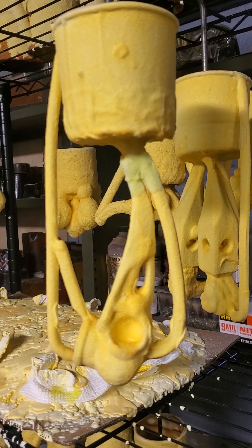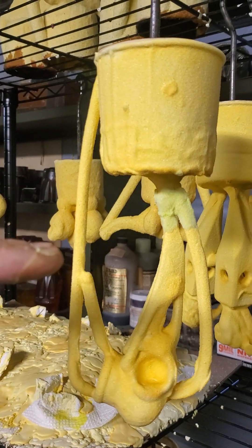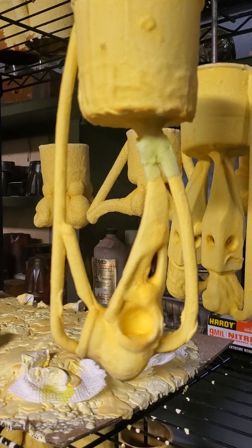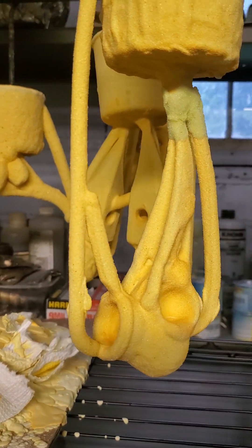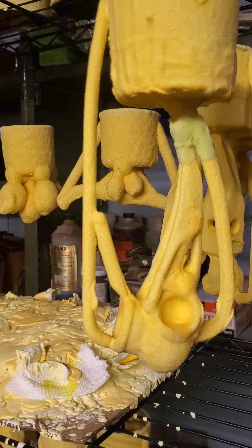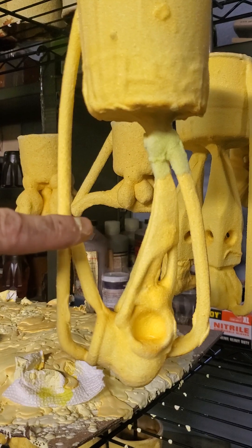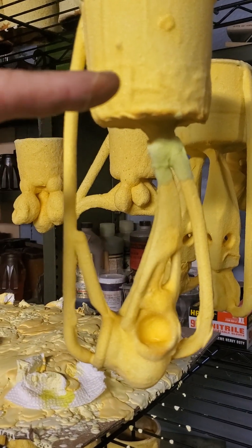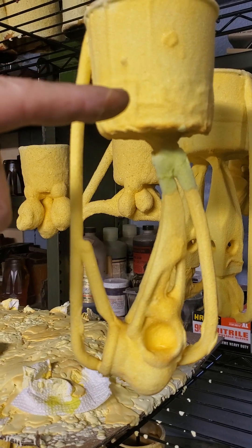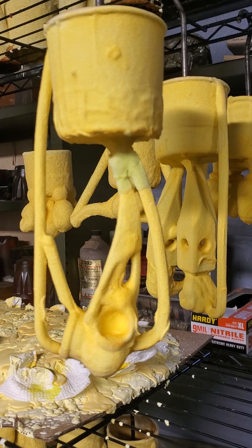What we really want to do is orient it the opposite way — or maybe horizontal — so we think about how the eyes drain and how this little cup drains. That cup is just going to be the top of a wooden handle for a cane, so we've got the weight of the material coming into the weight of the piece. We have less shrinkage because we've got head pressure from the cup above — that's going to be a better way to go.